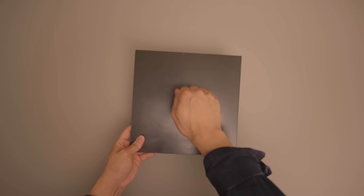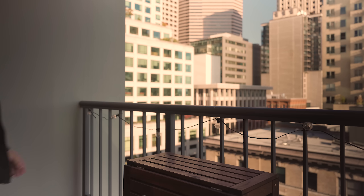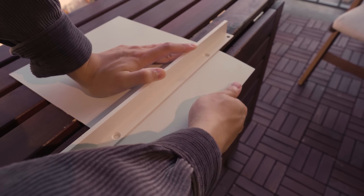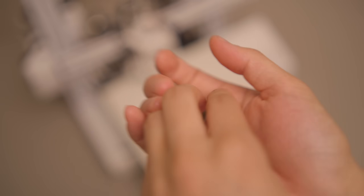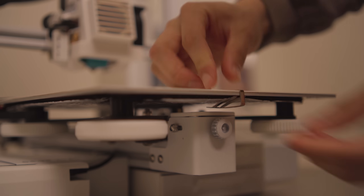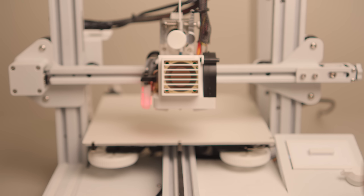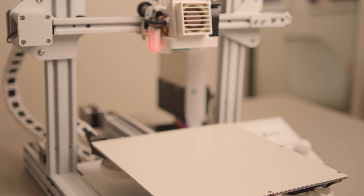As much as I love the glass bed for its durability, it's definitely not great for bed adhesion. So I decided to try the Garolite or G10 material everyone's been raving about. You can find these cut to size for the Ender 3 printers, or buy stock sheets that come in more colors and thicknesses. These thin 0.03-inch sheets are super easy to cut, but just make sure you do it in a well-ventilated area with a mask and eye protection. I sanded it with some water to reduce the dust. Now the old bed clips aren't going to work anymore — they're too loose. I'm trying picture frame clips, which work with both the glass bed and the thin G10 material, so I can use them interchangeably. They do have some sharp edges though, so I covered them with electrical tape so they don't damage the heated bed. I then ran a bed adhesion torture test and... yeah, that's pretty good, right?